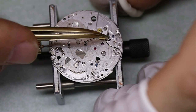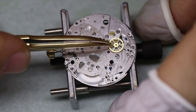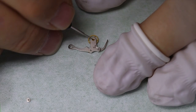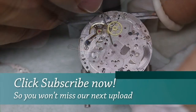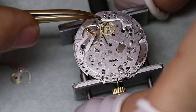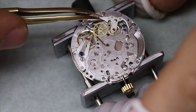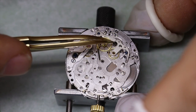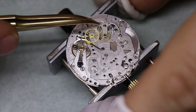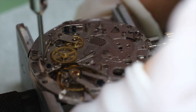So we can commence with the chronograph. We've looked at quite a few chronographs on the channel so far, and we're going to do the Seiko 6139 just over Christmas or in the new year. The El Primero sort of keeps to its roots - it is a column wheel chronograph with a horizontal clutch, the classic layout - quite different in that sense from the 7750 family.